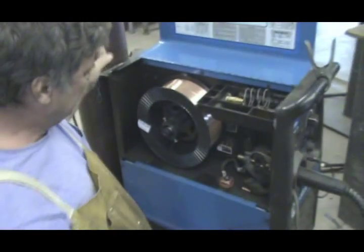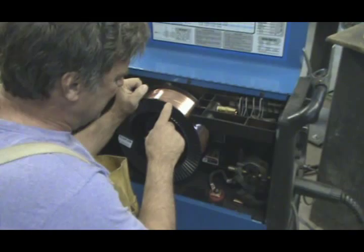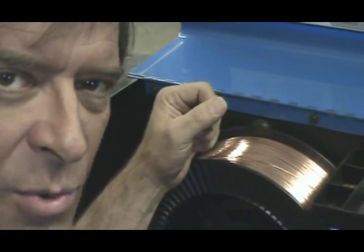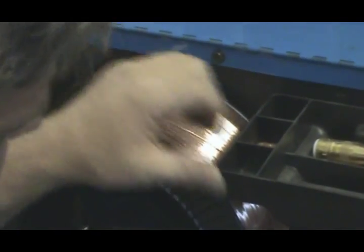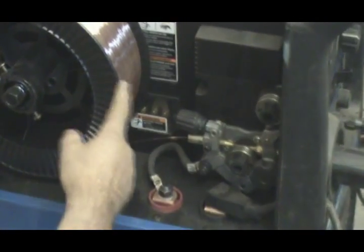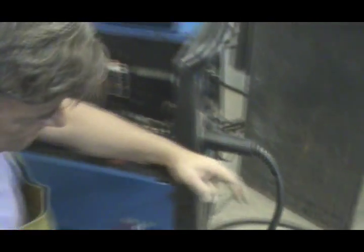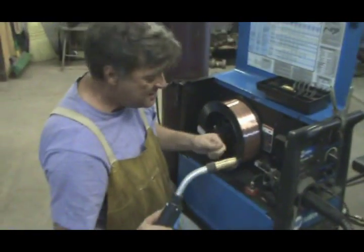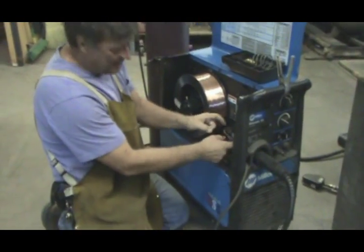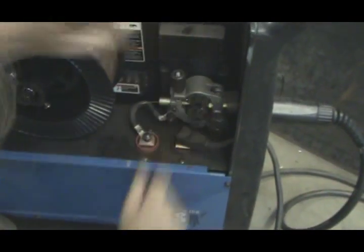Look inside here. See, this is the big spool of wire — 30 pounds of wire. This is steel welding wire, mild steel, but it has a copper coating on it just to help preserve it so the wire doesn't rust. This is the little drive unit where the wire comes off the spool and feeds through. It goes out into the cable that goes out to the gun, and eventually it comes out on the other end. So all you do is just unspool a little from your reel, feed it through, get it through the other end, get it stuck through here, and you can just close that up — that little thing locks closed.